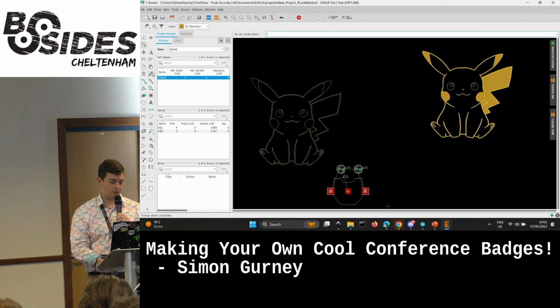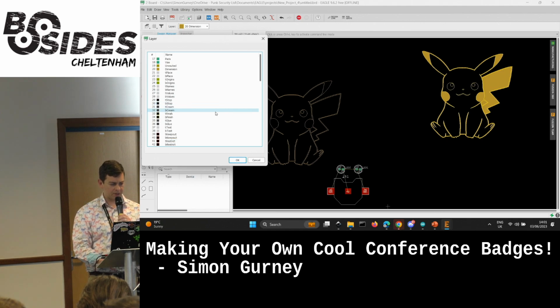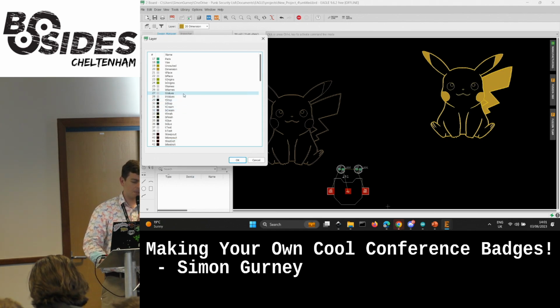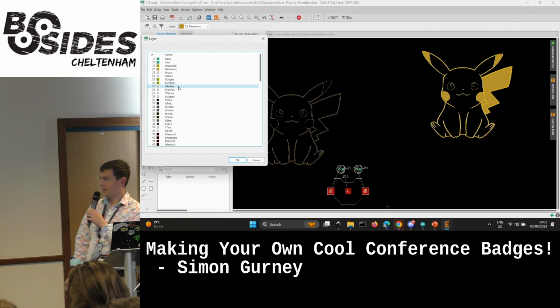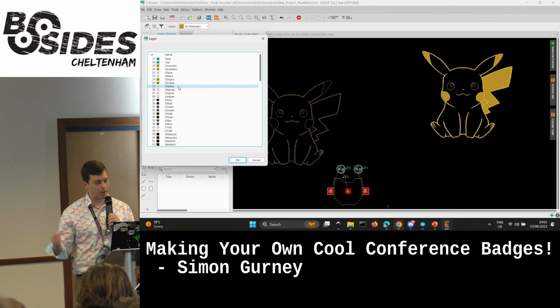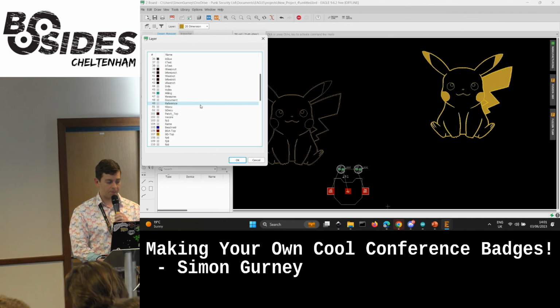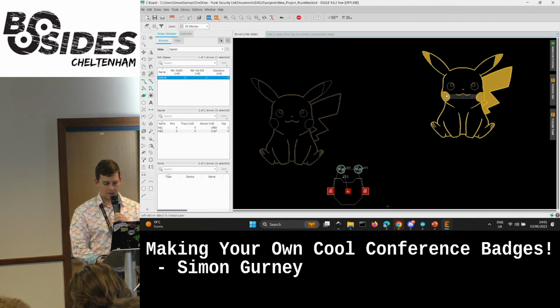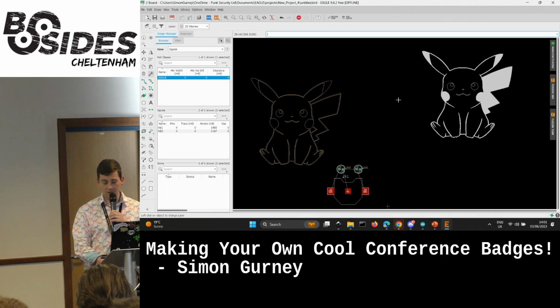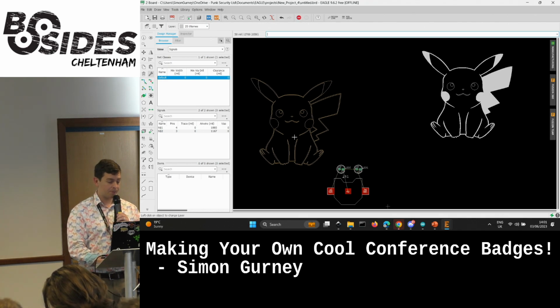You've got this change tool here. So you change the layer, and we want to put him on the silk screen layer. You can basically choose this at the end. The default ones are names and values because they're designed for the names and values of the components which would get printed to the board. I tend to not use those and use tDocu and then add it in later on, but for ease right now, we're going to use that one. Let me move him. Cool. He's gone white there because that's what the layer is represented as. So now that would be the white that's printed on the board.